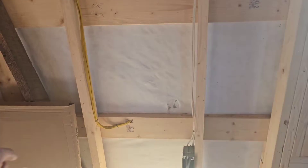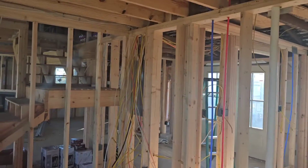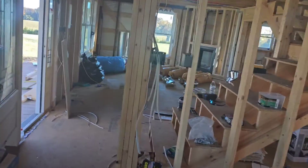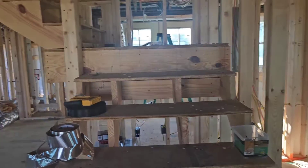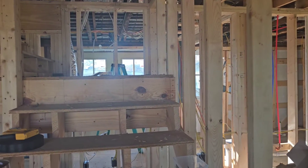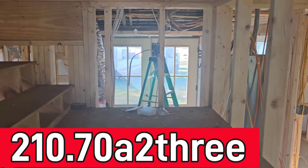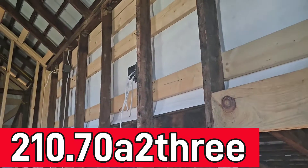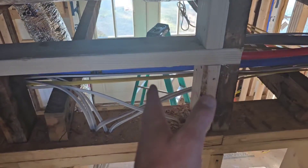Here in the living room, we have to be within six feet of that wall there, then every 12 feet thereof all the way around, and would have to be within six feet of that wall there. He's going to work all of his branch circuits in. Now let's head up these stairs. As we head up the stairs, we quickly see that we have more than six risers. The only required place in the NEC that you have to have a three-way switch is on a set of stairs — you can actually have a thousand-foot hallway and only have one switch. So we only have to have one three-way in this entire house code-required, and it would be from right there to right there. We have a landing here, and the question is: do we have to have another switch? The answer is no, unless it opened up to a door going into another room.